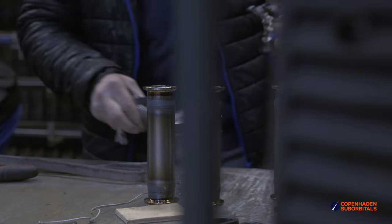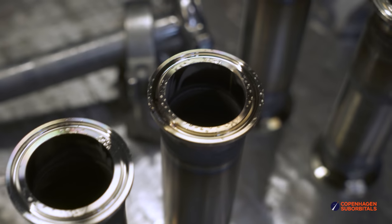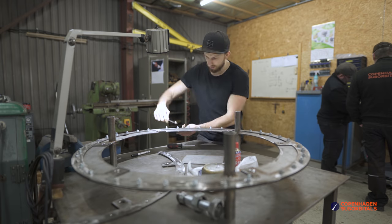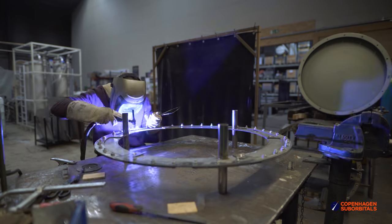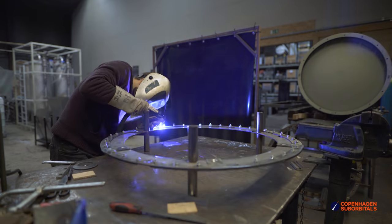Then Meinke quickly welded the pipes that will go onto our propellant tank bulkheads in a few weeks. We still have a couple of flange rings to put together on a welding jig and do a little more welding on them before they can go onto our bulkhead side skirts. Unfortunately, the last flange had a poorly cut section, so we'll need to order some new sheet stock before we can plasma cut a new one out.